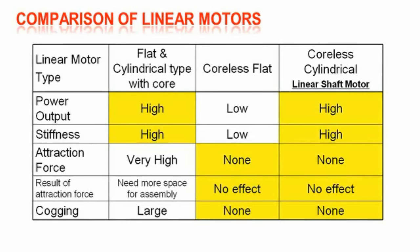This comparison chart shows the different types of linear motors available today — a quick and easy way to see the strengths and weaknesses of each type for whatever application you need. Mitsubishi made the decision years ago that they didn't want to deal with the negative issues of iron core type motors, and saw that the U-shape or coreless flat motors just didn't have the power they required. Once the performance of the new high precision linear shaft motors became available with none of the issues of the other two systems, it was off to designing them into the MV Series Wire EDM machines.